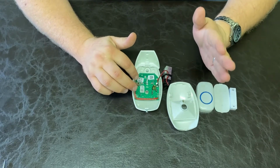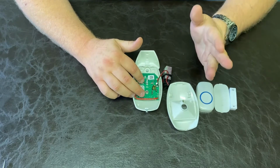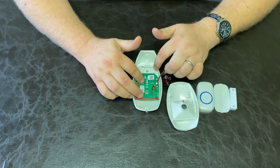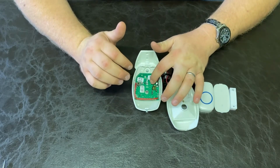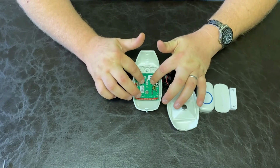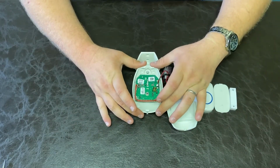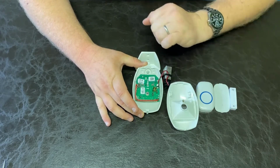When transmitting to a MAMI alarm panel, you will add 7 to whatever the zone number is. So for zone 1, you will press the increment button 8 times. 1, 2, 3, 4, 5, 6, 7, 8. Then step. Then press both buttons again to close programming. Now this passive is programmed with the code 151 and it's for zone 1.